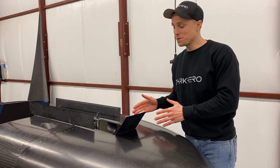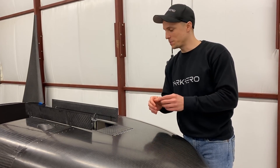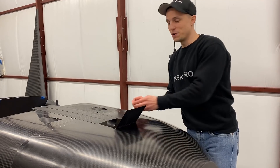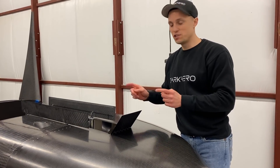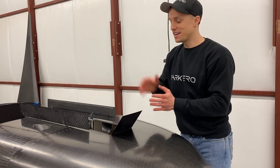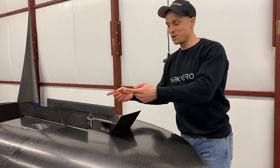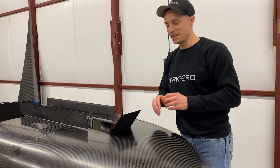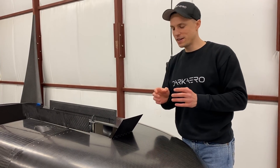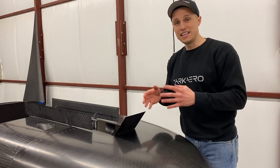So there we have it — the completed nose gear doors for the aircraft. We have this forward hinging door that's actually going to connect to the strut leg itself and articulate with the leg as it moves up and down. And we have the aft two doors that open left and right. We considered a lot of different configurations: a J-style hinge, a single door attached to the strut leg, a no-door setup, a single door hinging from one side, and even a door that would roll up and fold in on itself. We're really pleased with these ones, and ultimately we chose this path because these doors fit the best overlap of requirements for core functionality, manufacturability, cost, weight, and ease of install for the builder.